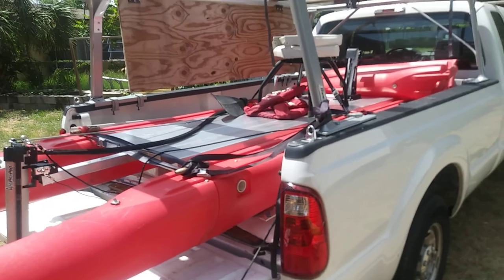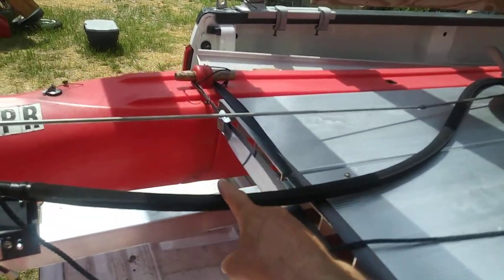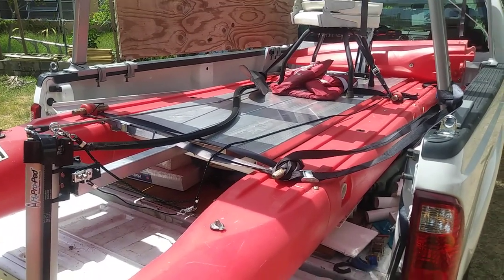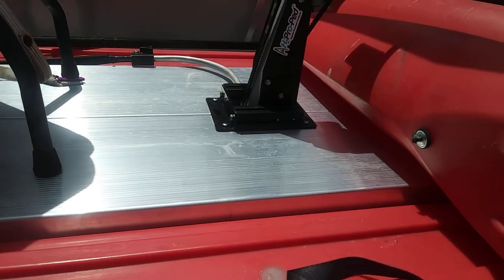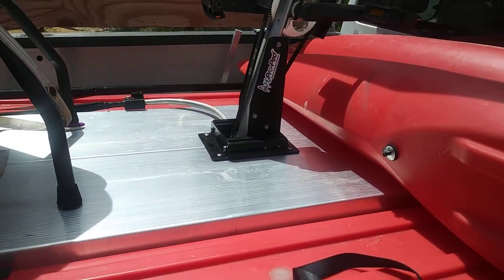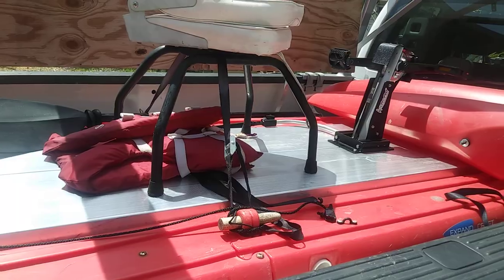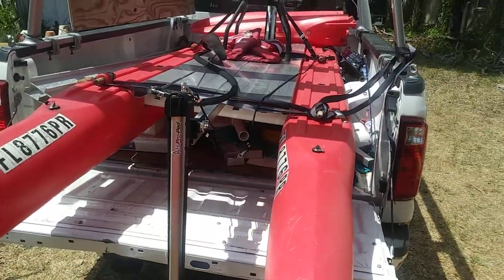It was a fairly easy adaptation. You'll notice I have this off on this long pole — I did that because the cable within the tube was longer than I needed it to be and there's no way really to shorten it, so I'm going to check with the manufacturer to get that at a specific length. I also simply put bolts down here with wing nuts underneath so it's pretty quick to disassemble. And I'm going to make some kind of slider mechanism so it can go forward and backwards six or eight inches. Right now the seat moves forward and back instead of the pedal drive, so I might make both the pedal drive and seat adjust for even more options.